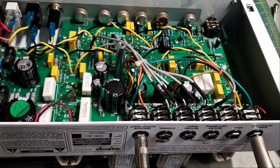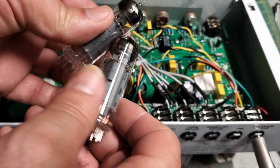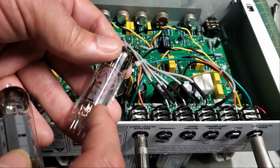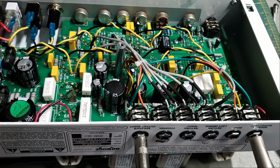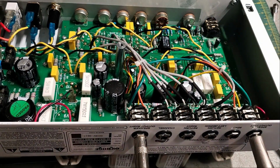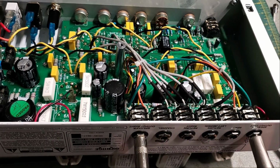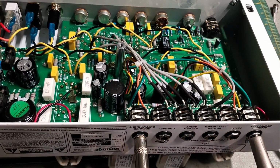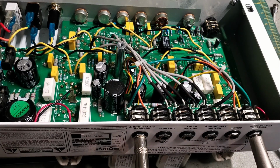So, this amp is seeming pretty healthy, but on each side, a pair of EL84s, you can see that discoloration where it started off red and has gone to that pale gray, has just been running too hot. These are toast. He needs new output tubes. But I had to make sure that there was no condition that I found that was causing that. And I don't mean to cast any aspersions on Orange, but there are an awful lot of factory amps that absolutely roast their EL84s, the Blues Juniors, the Classic 30s, the Classic 50s, many, many, many others.